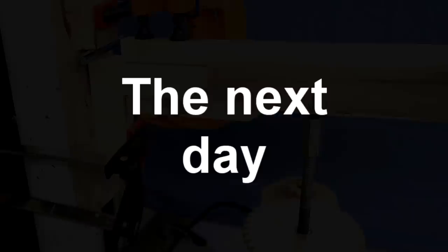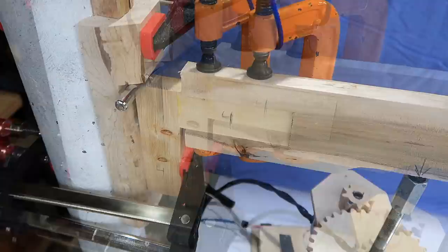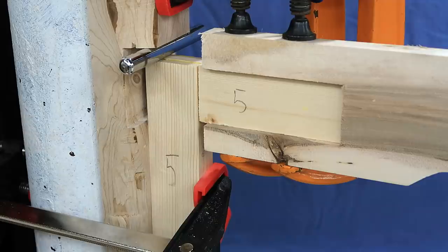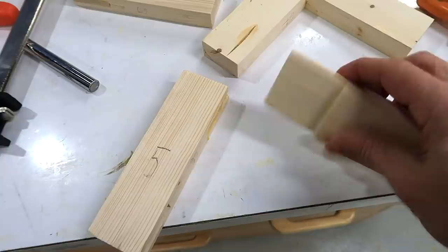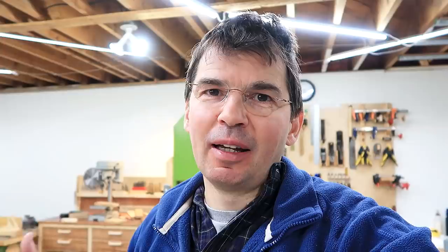It's only been 24 hours since I glued those together, so I think I need to give them a little more time. Fortunately I had five unpinned samples, so I've got three that haven't busted yet. Yet another glue failure at 70 kilograms. I wasn't careful enough selecting the wood, and this one failed in the wood. So my control samples have all been consistently failing with the glue, which is a surprise — because with this ratio of tenon, I usually end up getting the wood failing.